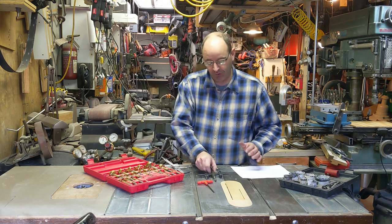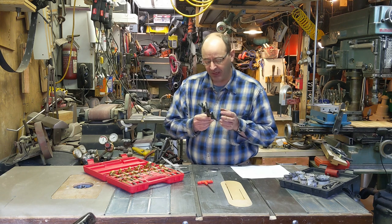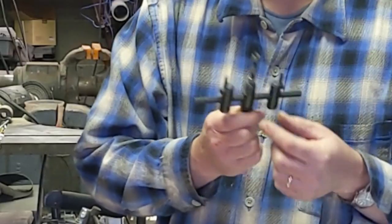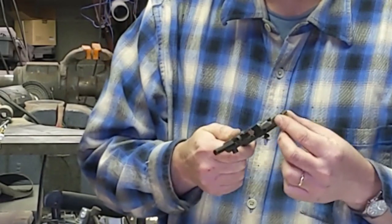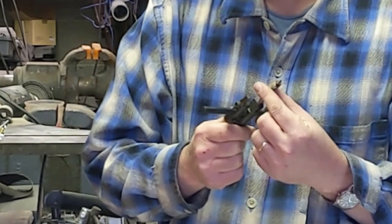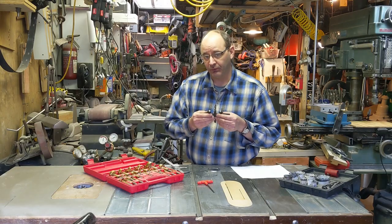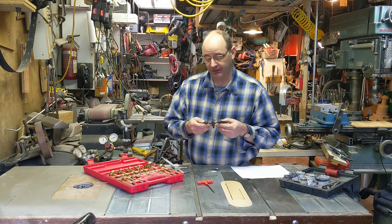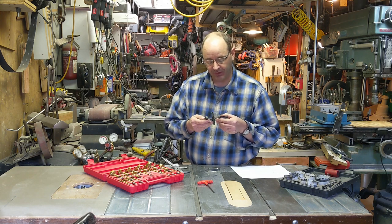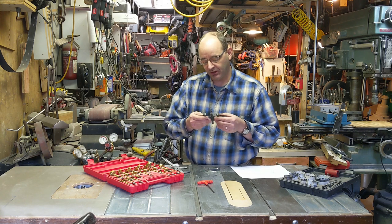So I'm going to go to another tool that comes in handy from time to time: a circle cutter. This particular one is made in Japan, probably in the 70s, and came with three different pilots. This particular pilot is an auger — a screw-type pilot — which I like a lot because it has a real nice bearing surface once the screw has gone through. A circle cutter is a really handy tool because it can make any size you need and produces a nice clean precision cut. But if you don't know how to use one, it will drive you crazy.